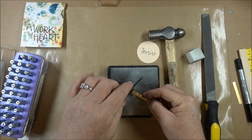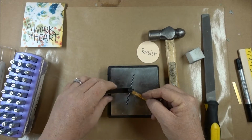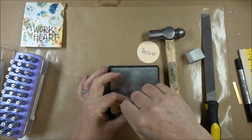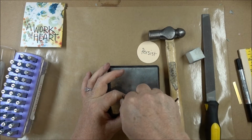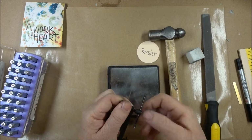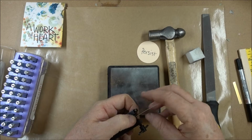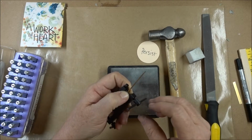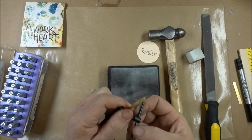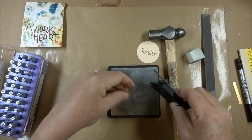1/16 of an inch. So I'm going to take this and advance the guide down until it lines up with the hole that I've made, and then I'm going to twist just until it gives. I can feel the punch go through the metal, and then this is rotating easily, so then I'm going to back this out, and I'll do that on the opposite side as well. So you get a feel for how to hold it so that you can hold your metal in there centered and twist, and you can feel it give. You don't want to go down too far because you can actually break the bit off of the end of this punch, so when you feel it give, that's good enough.